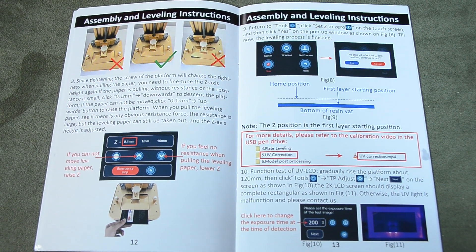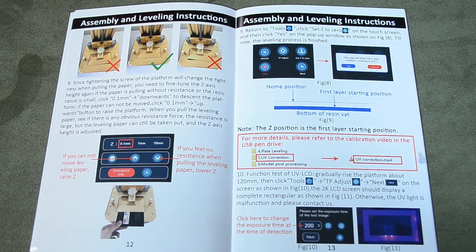There was a lot more in the box than I expected from a resin printer at this price range. While some resin printers come fully assembled these days, the Shadow 5.5S is not one of them. That being said, the assembly process is very easy. Basically, all you're doing is peeling some film off of some things, leveling and tightening the build plate, and then sliding in the resin vat. Every step is explained in very clear detail in the manual or through the videos on the flash drive, and I found it very, very easy — it took me about 20 minutes.